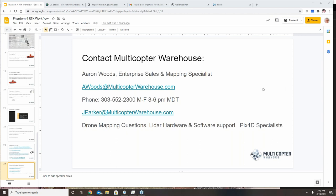Question: Have you found an advantage to inputting coordinates for the base station versus setting up over a random location and using survey GCPs in PIX4D? The advantage really depends on how much time you have. Setting up over a known point is ideal. Setting up over an unknown point means you need ground control points. I'm not a licensed surveyor, but every surveyor I've spoken with emphasizes: if you can't get the same answer twice, you haven't gotten the right answer once. I always recommend setting up a couple of ground control points in your project regardless.